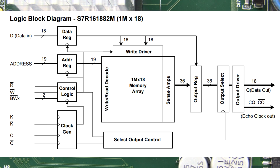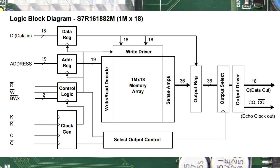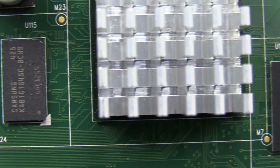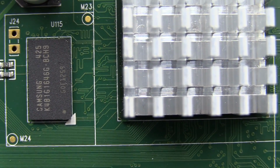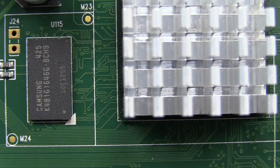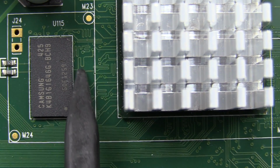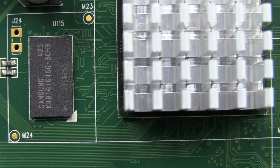The 256 levels and all that sort of jazz. Has to be super duper quick, and that's why they've got an SRAM in there. And on the other side of that, they've coupled on a Samsung 1 gigabit DDR3 memory as well. So that's an interesting combination of those two there. And of course, you'll note the length matching traces all in there. Nice little wiggles. I love wiggles.